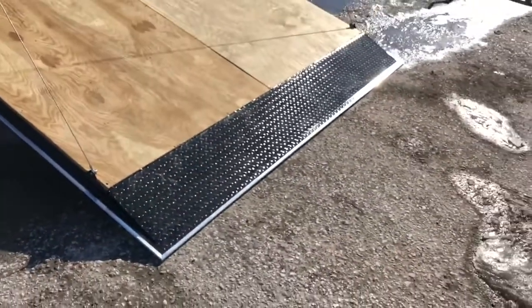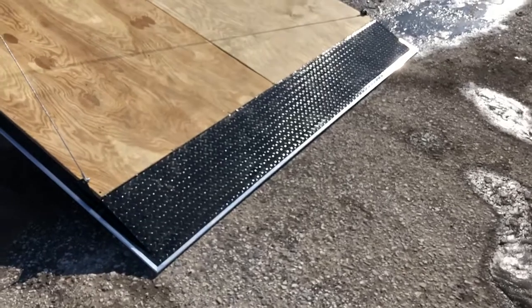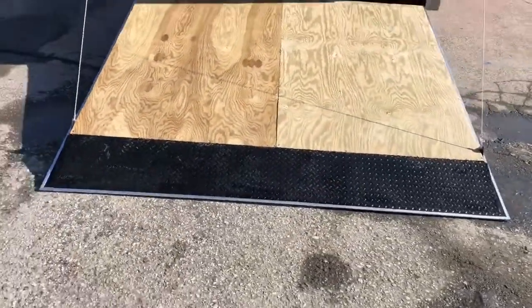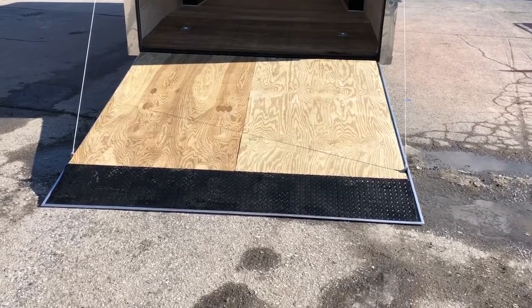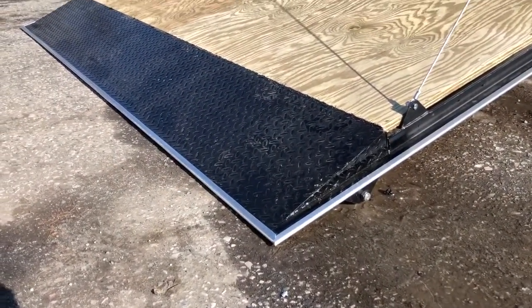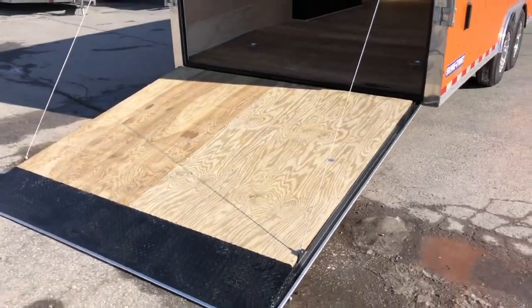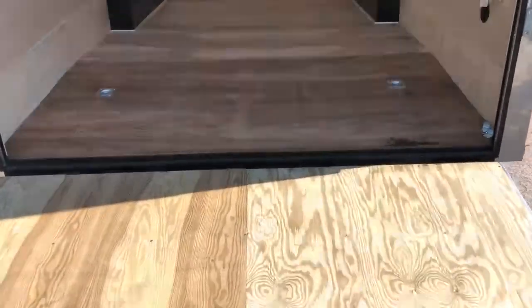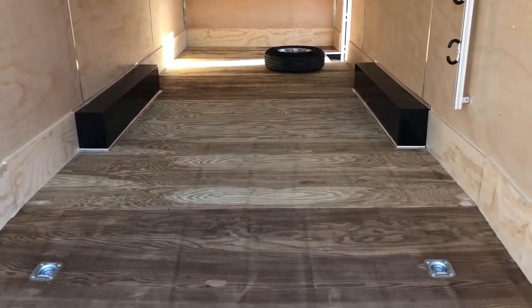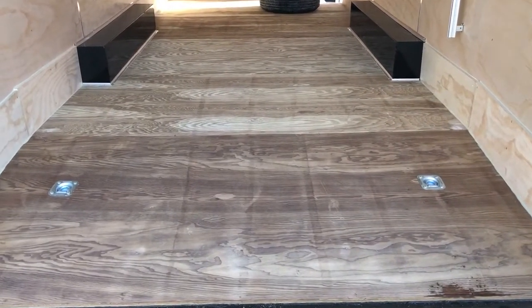Short Track does a super-duty ramp standard. One of the extra things they do is put a tread plate transition on the end — makes it nice. If you've been a landscaper long, you've probably experienced a plywood flap extension coming off that needs to be fixed or replaced. They integrate this, so you never have to worry about a flap extension. It's very heavy-duty and gives you a thin transition — down to about a half-inch or less. It is a treated plywood floor. Standard spec would be 12-inch on center with a formed floor crossmember, but this 14K actually upgrades to a 2x4 box tube crossmember — very heavy-duty floor, actually heavier than what's on a dump trailer.